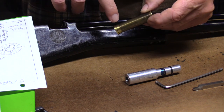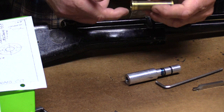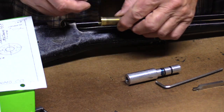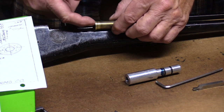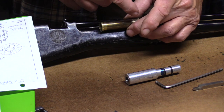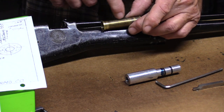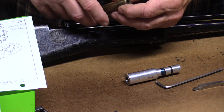You notice there's a lip here, and that fits against a shelf inside the tube. Back in the 1930s when they made these, they used asbestos — some kind of asbestos thread or twine. This was secured with a nut to push it up against the seat in here, and that prevented the air when you're pumping it from getting around and forced it into the intake port.